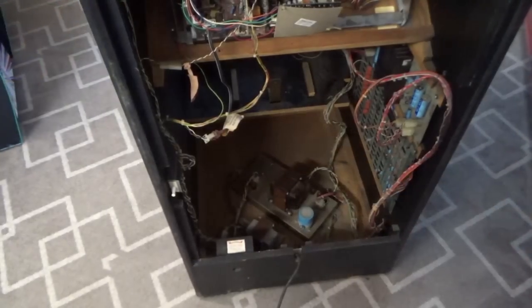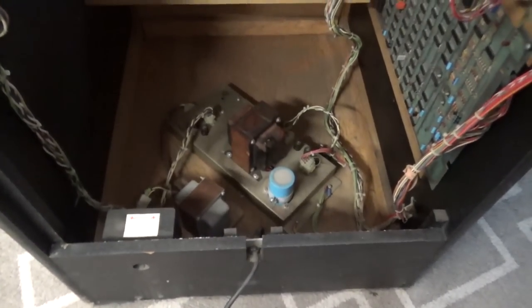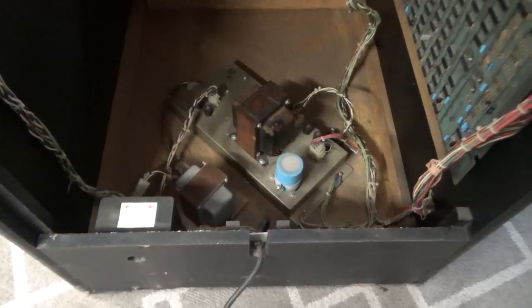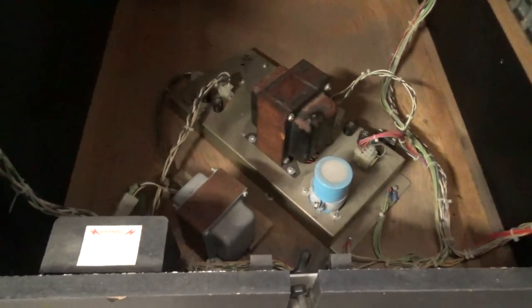I'm going to plug it in and see what happens. Well, I plugged it in and just as I thought, it's broke. It's not doing anything. So I know I've got my interlock open. I've tried my switch both ways. You gotta be careful on these Ataris. There's another interlock switch up there in the front. But somebody's already bypassed that, it looked like. So now I gotta get out the multimeter